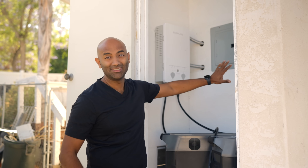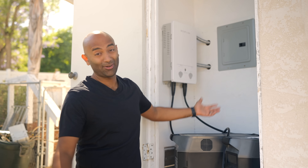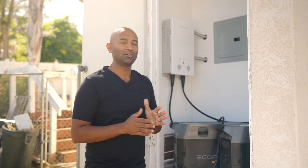You might be wondering: why should you care? Is this something you should consider for your house? For us, we have a lot of electrical needs — we're going all electric with heat pumps — so we needed a pretty sizable system. Also, because it's a smaller house, we only have 10 circuits in its entirety, so this EcoFlow smart home panel can back up our entire house. Every outlet will now work, even if the grid goes down. But if you have a bigger house, this might not back up the entire house — you'd have to pick and choose which circuits you want. I'd recommend refrigerators, lighting, maybe one of your core rooms, and other critical things. If you need a bigger system, you can install more than one of these and hook them up to batteries, but at that point there's probably a better solution for you.